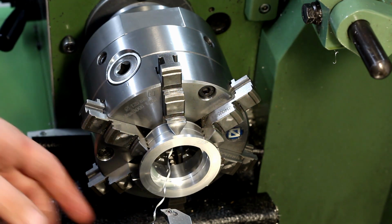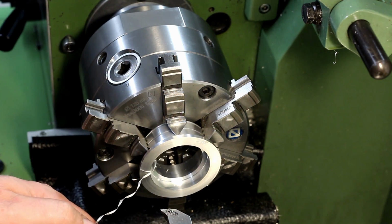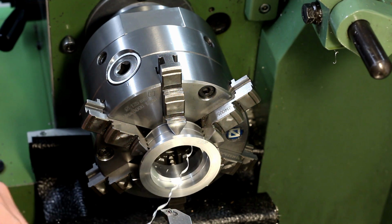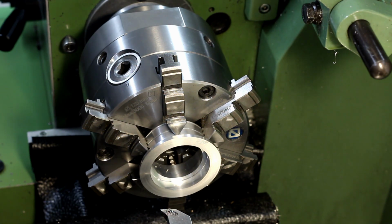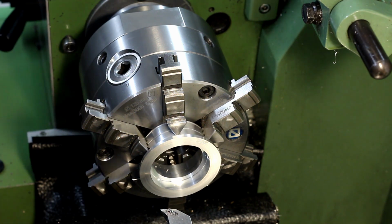Oh, and one pro tip. When you grab a chip and want to pull it out of the machine with the spindle off, if the chip gets snagged somewhere, don't pull. Don't pull and cut your hand open. Test it for you. It works. It bleeds like crazy. Use a plier or a chip hook.